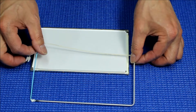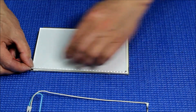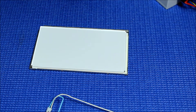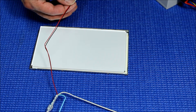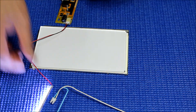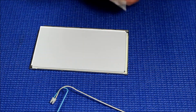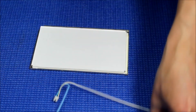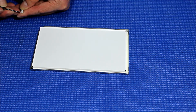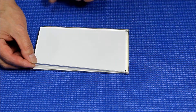As I said, this is an L-shaped lamp. So instead of using the L-shaped LED, we're going to use a straight one like this — the wire will come out this side, same thing. Before we do that, we're going to test our LED first to make sure it's working. We're going to mount it all the way here; the wires come out here because that's how the lamp was mounted, so we're going to do the same thing. We move the double-sided tape cover, try to align with this side all the way, because the wire needs to come out this side.